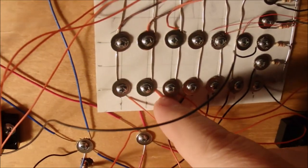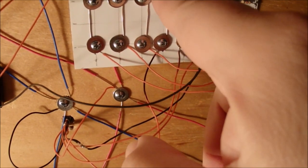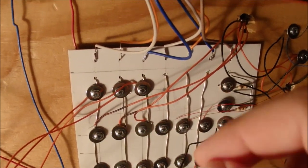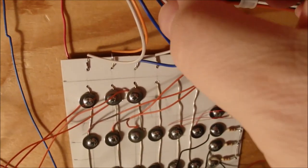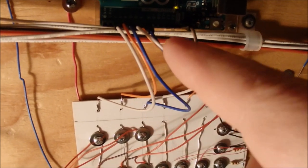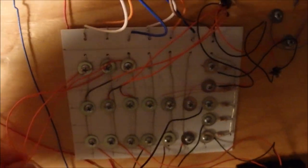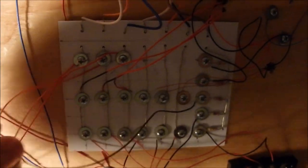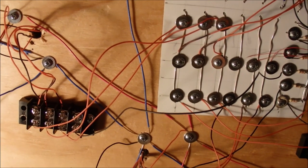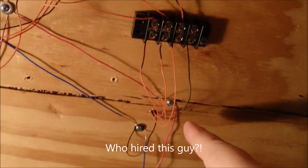All the ground wires come over here — I've got five lights and five ground wires, each one with a 1K ohm resistor that connects to the ground on the Arduino board. These first three are the north-south lights and the others are the east-west lights. One traffic light pole comes in with four wires — red, yellow, green, and ground — going to the barrier strip and back to the connector board, where each terminal connects to the Arduino. I'm trying to figure out a good way of securing all these fine wires.